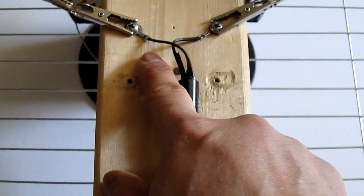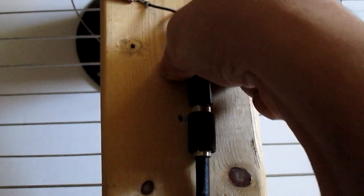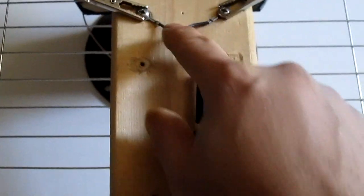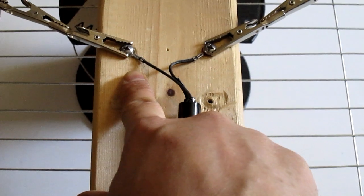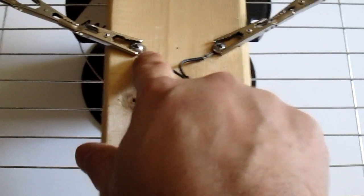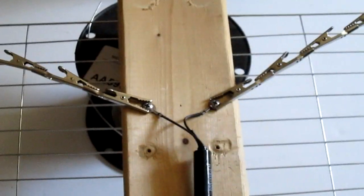When I switch a certain way, I was able to get channels this way right here, even though it sits this way. I was able to get a lot of channels by doing that. So remember when you make your antenna and if you don't get an improvement on channels, switch these two — instead of putting it over here, put it over here instead, and vice versa. That is very important. No one actually mentioned that, and it does make a difference.